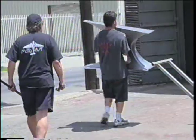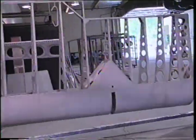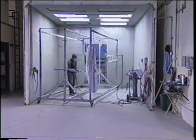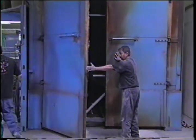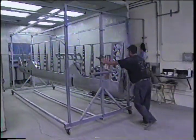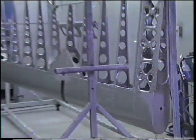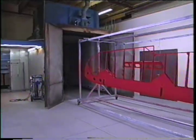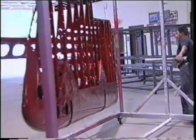All the pieces need to be powder coated through a two-step process. First, they're sandblasted thoroughly to give the metal a gritty tooth. Then a small electrostatic charge is attached and powder is sprayed at very low PSI so it adheres evenly. The piece goes into the oven for about an hour at 350 degrees, then it's brought out and cools down. The C-54 rudder, being a metallic finish, goes through a three-step process — a translucent red overcoat is shot, then it goes back in the oven, baked again at 350 degrees, then allowed to cool.